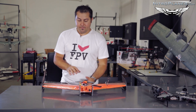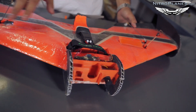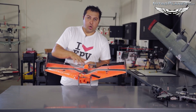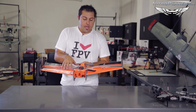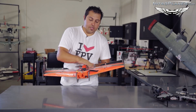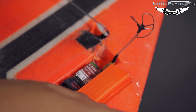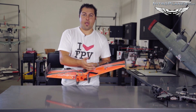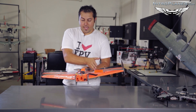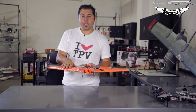This aircraft is set up similar to the RC car, with the receiver here. I'm running the Dragon Link 433 megahertz. I've got my antenna clear across on the other side of the wing. Working with a small aircraft like this, you don't have much real estate. I've got my video transmitter on the opposite side — same side as my camera — to keep wiring less cluttered. I've built a little hatch so I can swap out video frequencies, making my video transmitter swappable. There's ample separation between the video transmitter and the RC receiver.